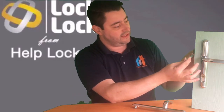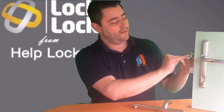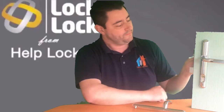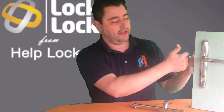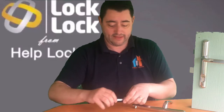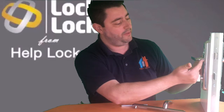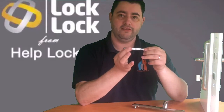On this spindle you'll see a small knuckle. When you push the spindle through the door and that knuckle hits the mechanism, the spindle won't go any further — stopping you from pushing the spindle up into the door to make the handle drop off on the inside. On the inside of the door, on the internal part of the handle, you have a pair of grub screws. When you fasten those onto the spindle they grip it, stopping you from pulling the spindle out, while the knuckle stops you pushing it back in.